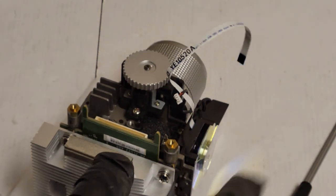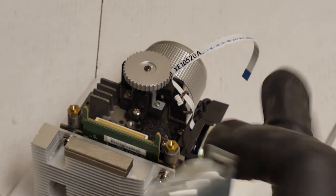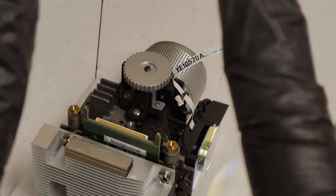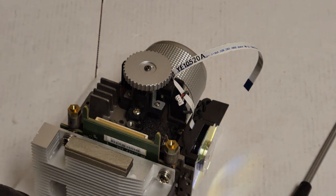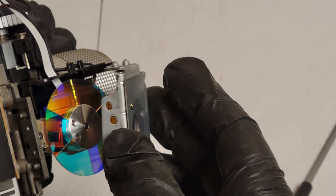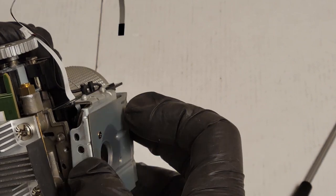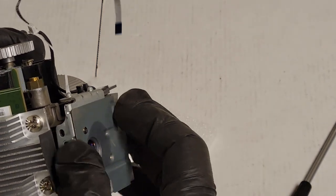I know I've actually had somebody recently ask me about a 3050 where they had, I'll do it on the camera here, blue like that, and then another shadow over here, and it was kind of dim. I believe the lamp was an original from BenQ, so it should be fine. You know, the usual. But I would be more surprised if it was a projector issue. I suspect a lamp issue in that case.